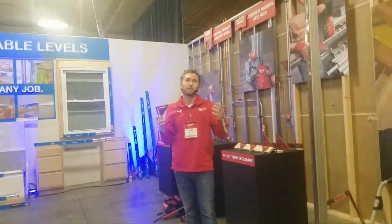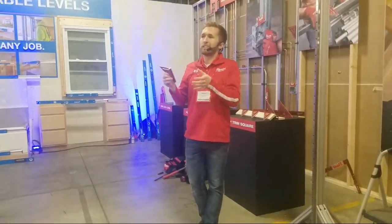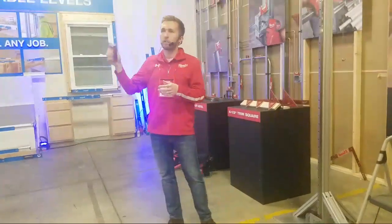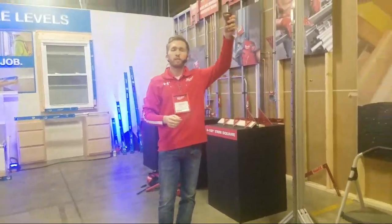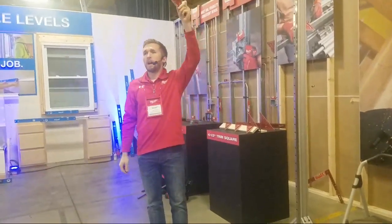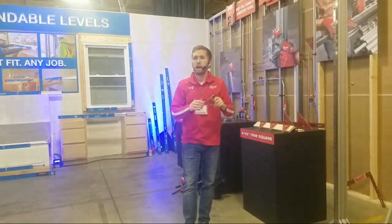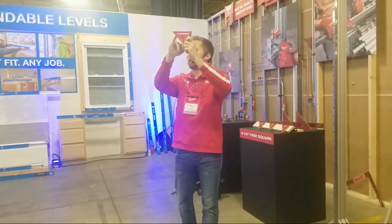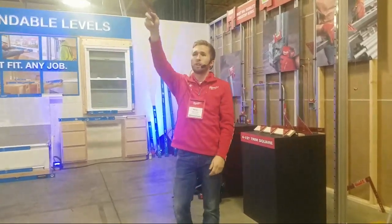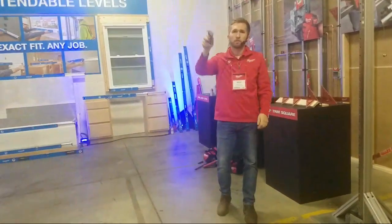It's now going to easily fit into your pocket, your pouch, or whatever tool storage you're using. And it's going to easily fit into tight spaces on the job site so you can make sure something's accurate and square every time. It also has the high durability, high visibility laser etch markings that our current framing and Rafter Square have. It has scribe notches at 1/8 increments to give you more precision, and a dual reference offset heel for quick checks of 1/4 inch and 3/8 marks on the job site.